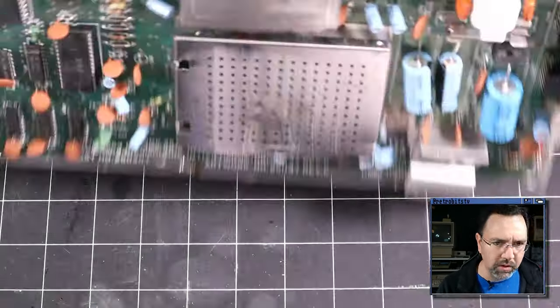Now, what we've got is a 250407 Rev-C board, and I found 250407 Rev-A. Schematic diagram 251138. Well, we've got a 251137 Rev-C. It's not quite the same as the one listed here, but hopefully it is similar or, you know, the same. So I'm going to take a look at this schematic and let's see if we can't do some identification of what the traces are coming to the CPU. I'd like to see if the CPU is receiving a good clock signal.